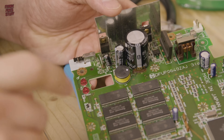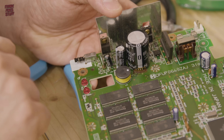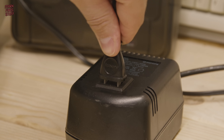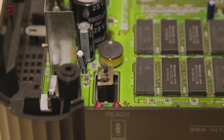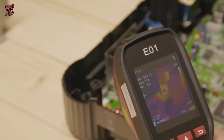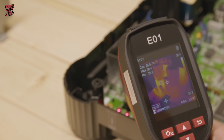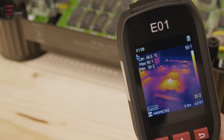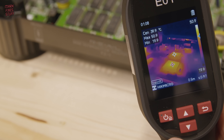With that done let's take it back over to the computer bench and test these capacitors. I've popped it into the case, connected the S-video cable, plugged it into the step down transformer, and hit the power switch — two LEDs is a great sign. I leave it on for five minutes and then check those temperatures again. There's not much in it but the new capacitors seem to be running one or two degrees lower. The integrated circuits are still hitting the same temperatures, which is normal for those ICs — they sure are toasty though.